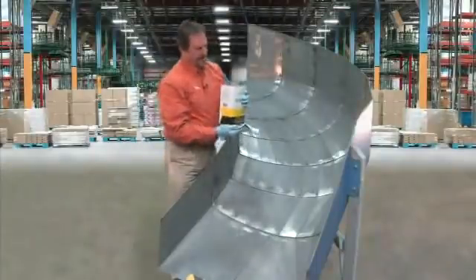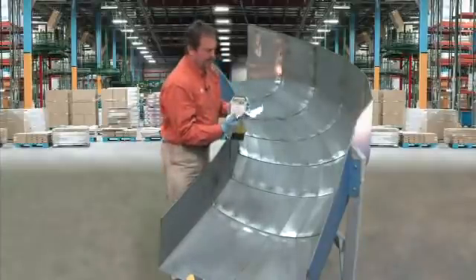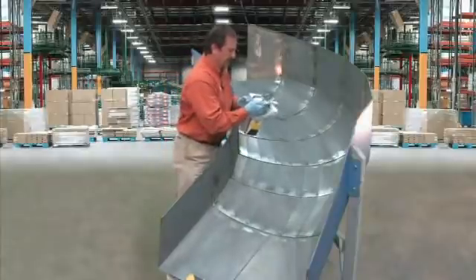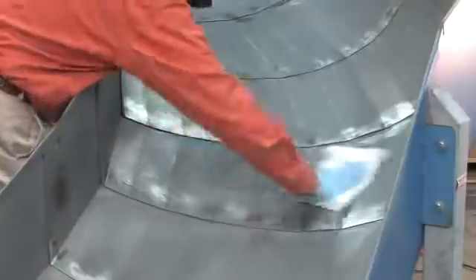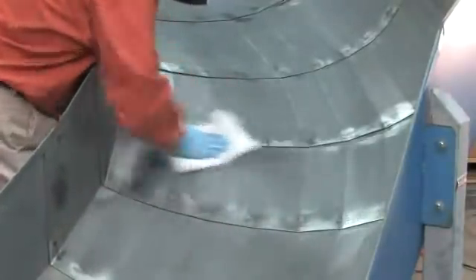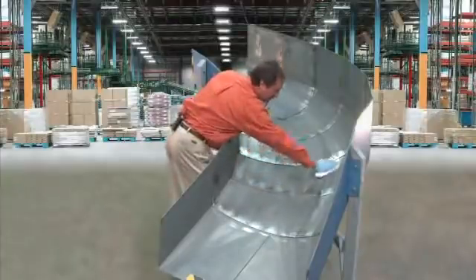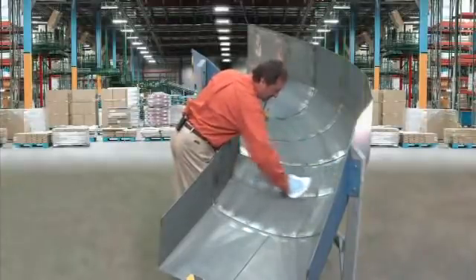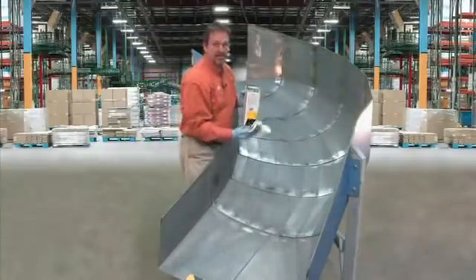Now the first step, as I mentioned, would be to wipe down the chute with the acetone. Make sure you use plenty of acetone on the rag — don't be shy about it. Make sure you're really getting a good clean surface and make sure you really get into these crevices and joints because there's going to be a lot of contamination that resides there. When you pull your rag up you'll see you have a fair amount of contamination on there. Be sure to turn or change your rag frequently to prevent recontaminating the surface that you're working on.